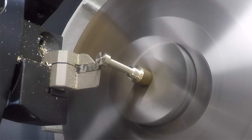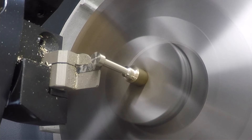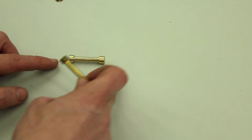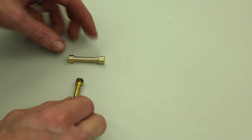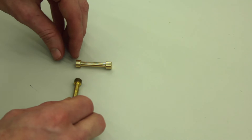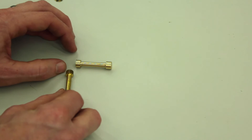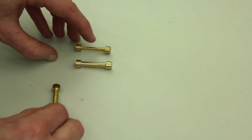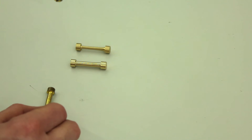You should aim for having no more than three times the diameter sticking out of the chuck, unless you're going to use some kind of tailstock or steady support. On such a small workpiece it's impossible to get a tailstock in, especially when it's batch work. So we're going to be working with a really tight back end towards the chuck — just enough room to get the grooving tool in to part off. This was about 15 times the diameter versus three times the diameter sticking out of the chuck.